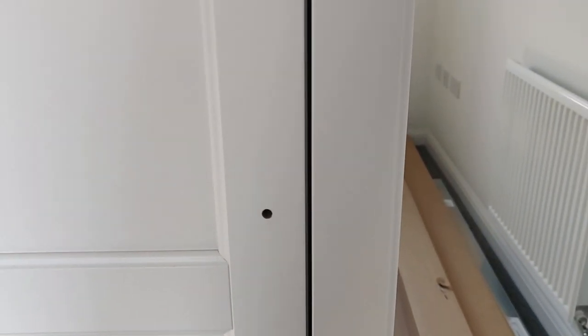Unfortunately, as you can see, the gap goes down. This is because the doors are not perfect, as you can see clearly here. The space is almost perfect on the left, but to the right it gets larger in the middle and then gets tighter up top. So the doors are not perfect, it's just the way they work. And it's not down to how you adjust the thing in the middle, it's down to the door, because the door is not so flexible that it just gets moved by the hinge in the middle. So be careful about how you put them in.